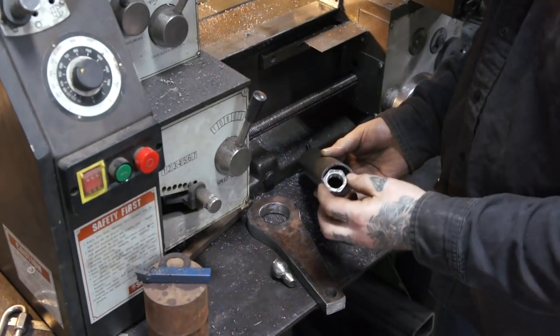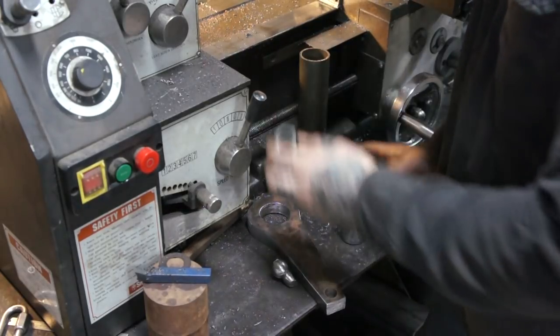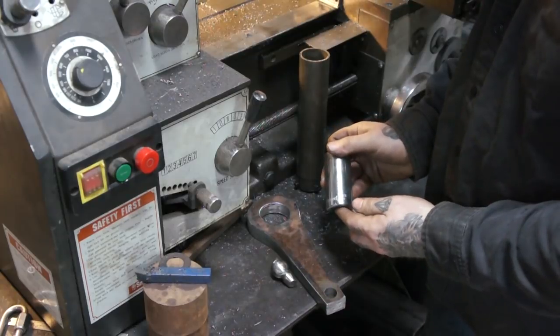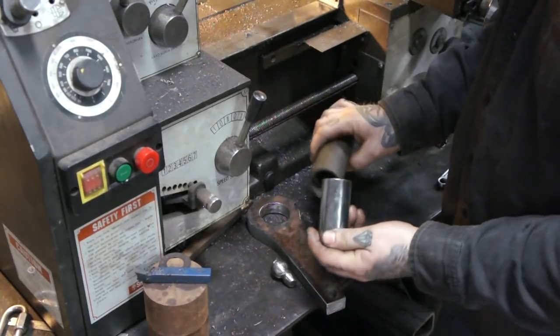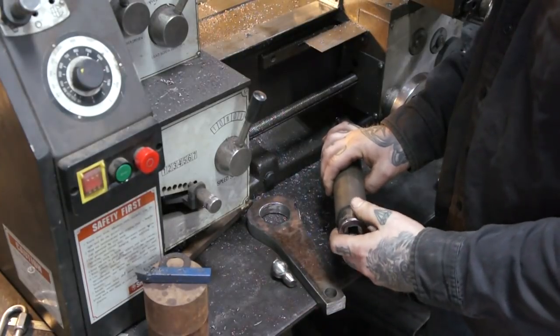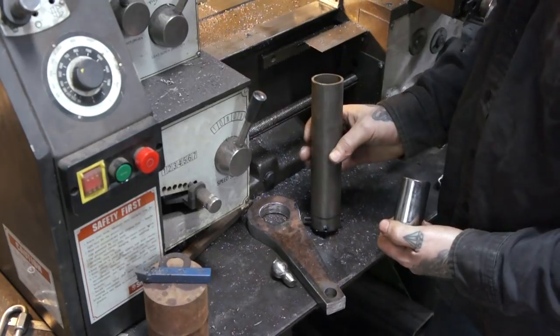And what that did is that allowed the nut to go down a size or two in socket size. So that slips down into this inch and an eighth socket now. And this inch and an eighth socket fits just inside of this tubing. So now we can tighten this down with this smaller socket, and we got tubing that isn't so obnoxiously large.